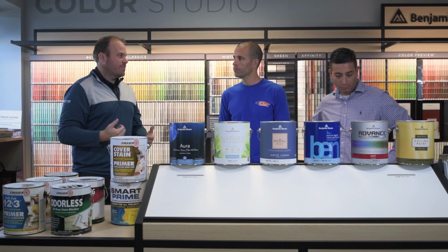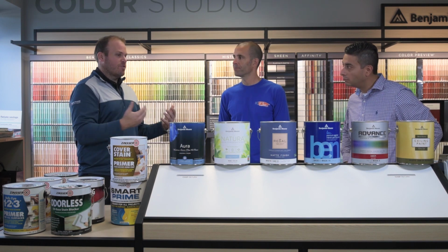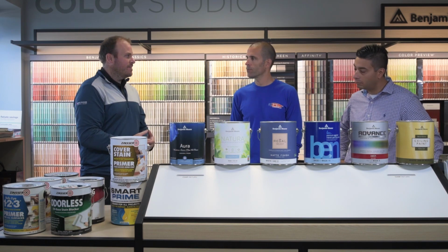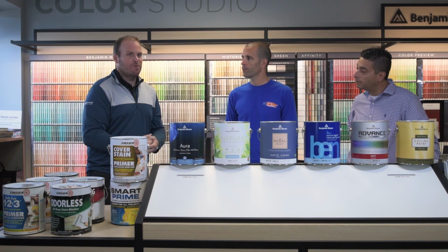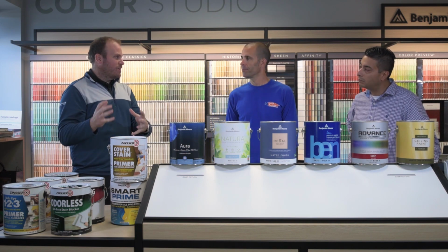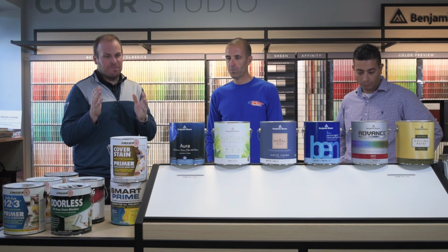So I do get a lot of calls that say, hey, I used your primer, and that stain's coming through. What happened? And my first question is, well, what was your process? Well, I painted, it was dry, and then I put the top coat on. Okay, so an hour and a half? Yeah. Okay, well, we didn't give it enough time. That's hard to tell people, but it's on the label. The reason we put it on the label is because we know what's going to work. Right. But give it time.